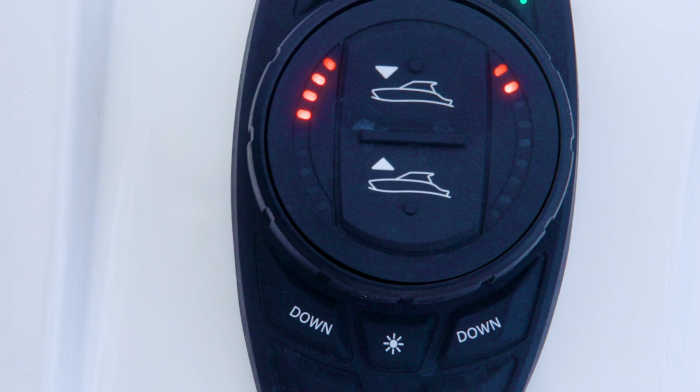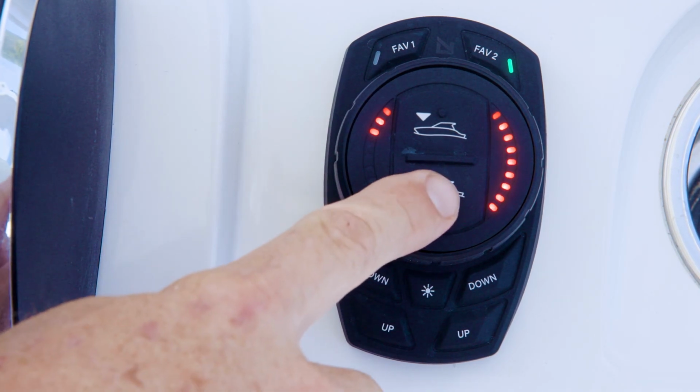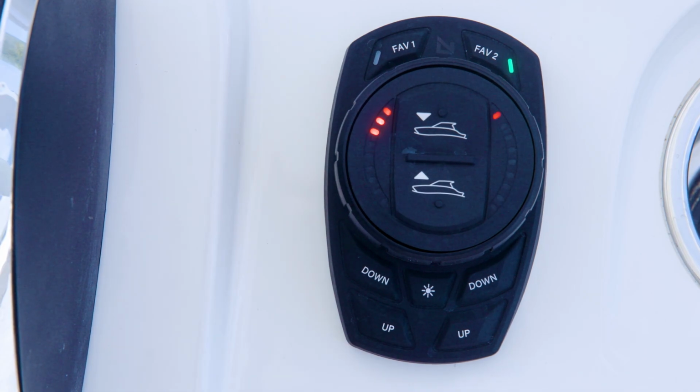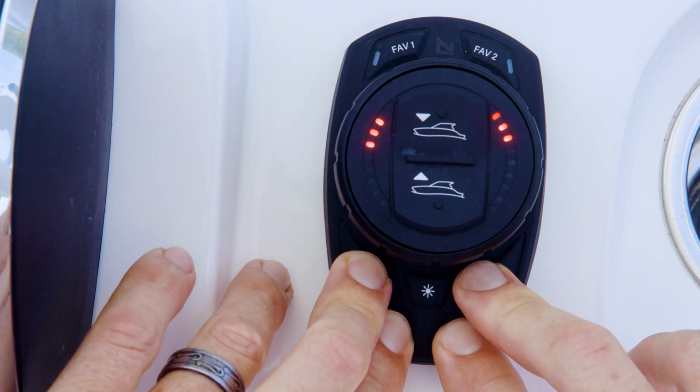Audibly or visually confirm that the starboard tab, and only the starboard tab, is pulsating. If the port tab is pulsating, press the All Up button on the keypad dial face once. The keypad will flash. Press the dim button, and now the starboard tab should begin pulsating. Once the starboard tab is pulsating, the system now knows the correct location of the port and starboard trim tabs. To exit the setup menu, press and hold all 4 lower up and down buttons for 1 second.